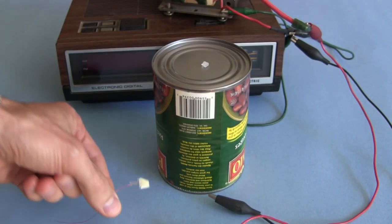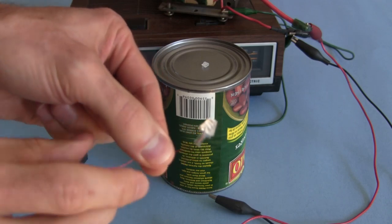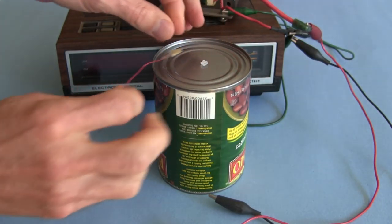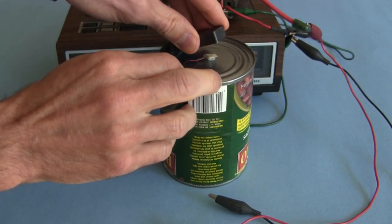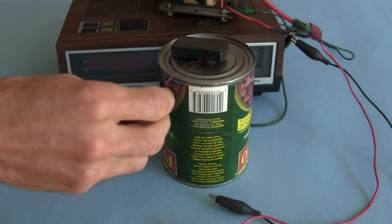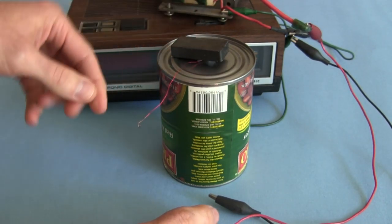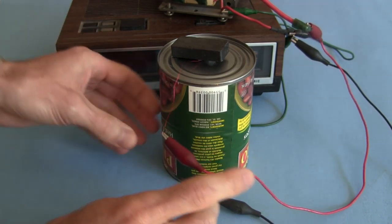To find a prospective crystal, I take a piece of wire and tape a piece of aluminum foil to one end. I put my prospective crystal on a can, put the aluminum foil over the crystal, and then put a magnet on top to hold it in place. This magnet is non-conductive. Then I hook it up to the output of my radio.